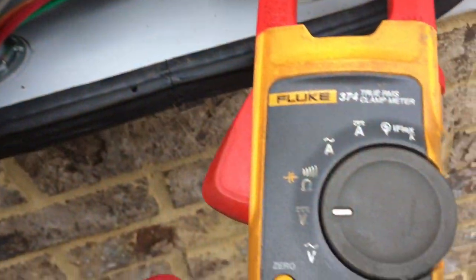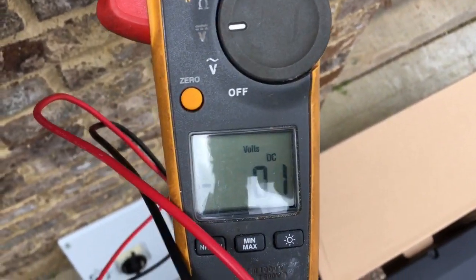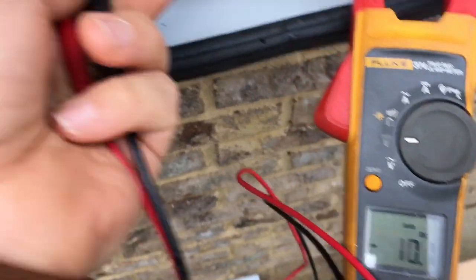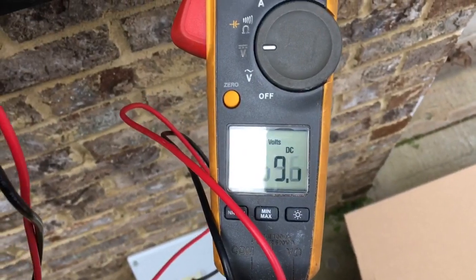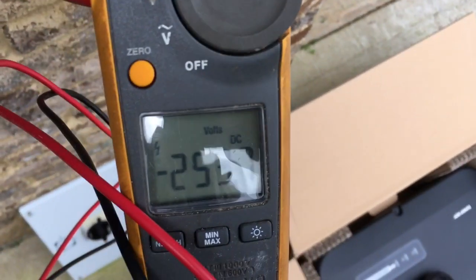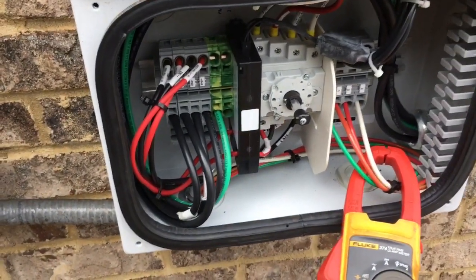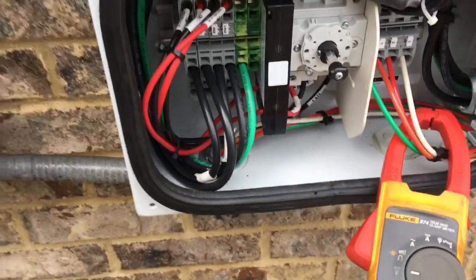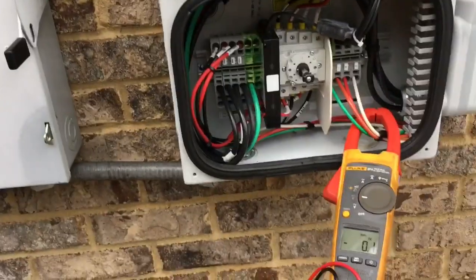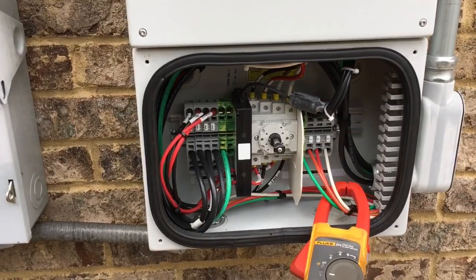There's really no good way to cut this thing off — it's about 250 volts on each leg. Unless I get up there and tarp the solar array or do this in the dark, I'm just going to gingerly and carefully remove each conductor and tape it off. Luckily I've got tons of extra wire to land everything.